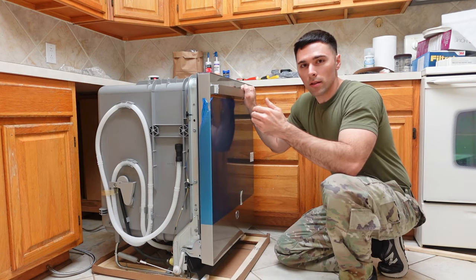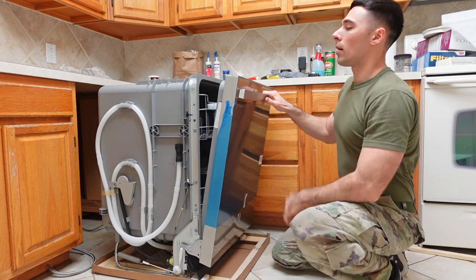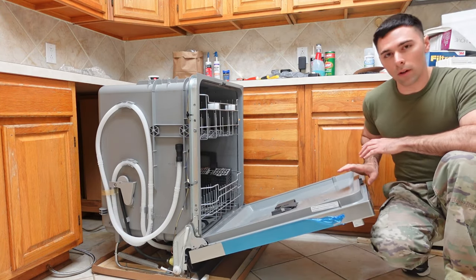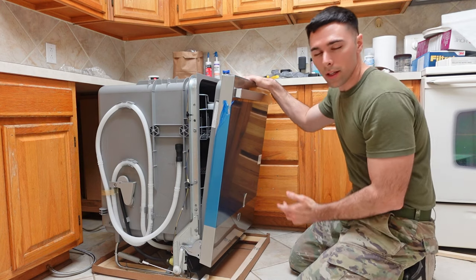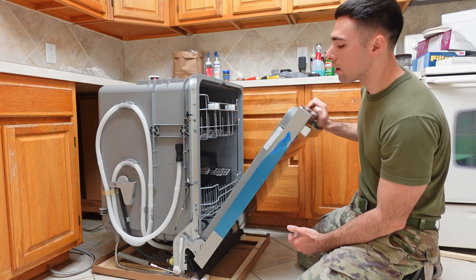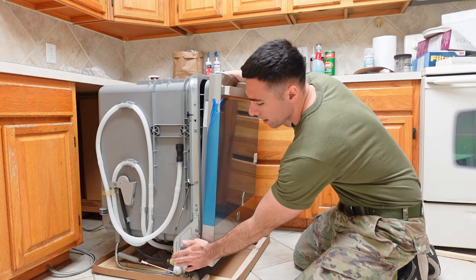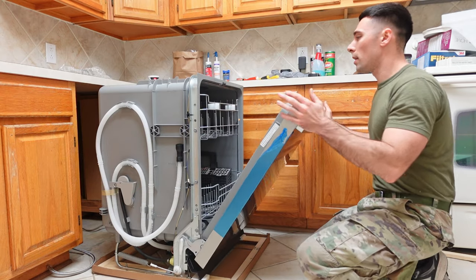The next step is to check your door mounts. You're primarily looking to see if it opens and closes smoothly. Within 20 degrees it should close on its own; 20 to 70 degrees it should stay open; beyond 70 degrees it should fall. My door doesn't fall on its own past 70 degrees, but I think that's primarily because the springs are brand new and still pretty stiff, and this door doesn't have a lot of weight to pull it down. It does open and close perfectly fine — very smooth with no issues. If you did have issues, now is your only time to adjust the springs and the pulley system while it's still out. Everything's good on mine, so I'm ready to move on.